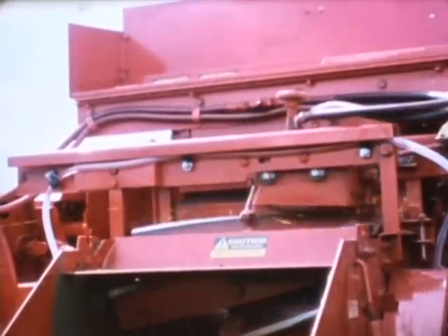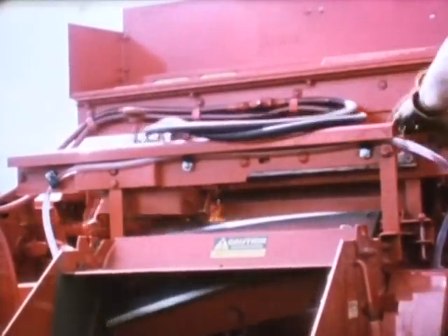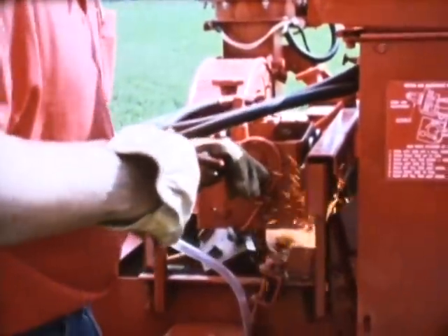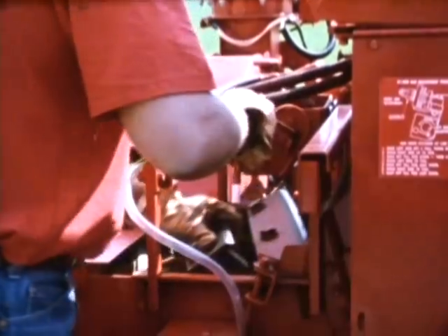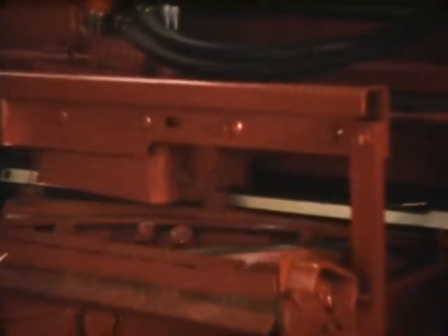You'll like the patented in-head hydraulic knife sharpener. Now you can resharpen the entire bevel of the knives right in the field. With regular sharpening, you can keep your harvester cutting at its best and reduce fuel and horsepower consumption. Another exclusive feature of the Gale knife sharpener is the ability to use the same sharpener to resharpen the cutter bar as well. You can really stretch your investment by refacing the edge of the cutter bar, increasing its life and maintaining your fine cut control.